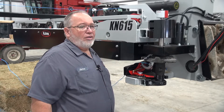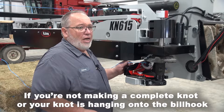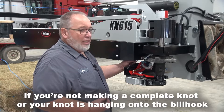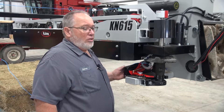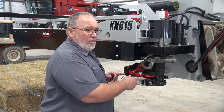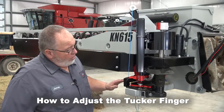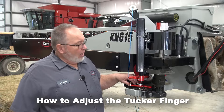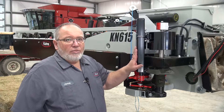...and you're still having a problem with either not making a complete knot, or your knot is hanging on to the bill hook, now we are going to make the adjustment and check the adjustment on the tucker finger in relation to the cam.